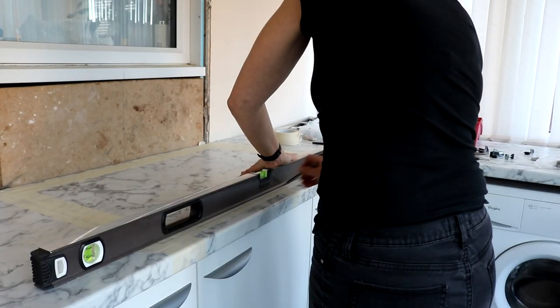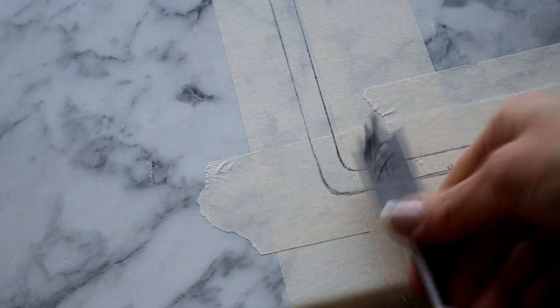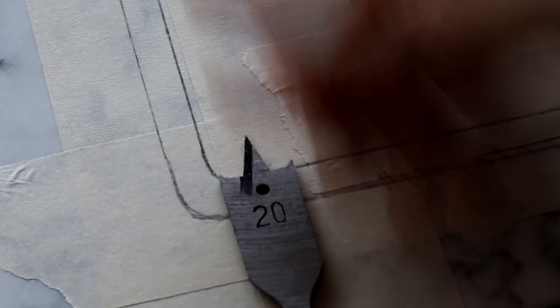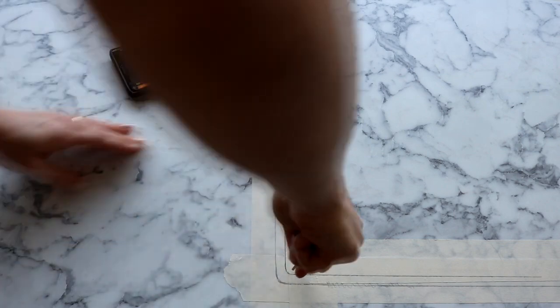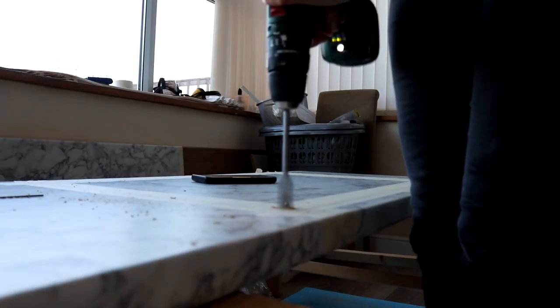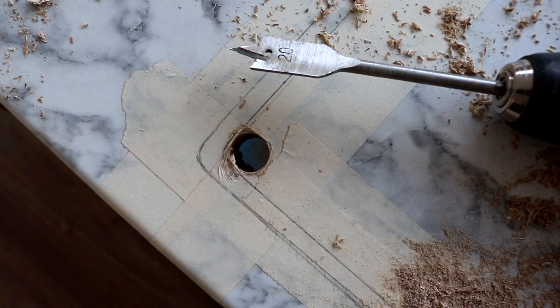For the corners I just artistically drew a curve. Then I moved the worktops to my sawhorses. I used a tip I'd seen in a couple of videos: line up a flat 20mm wood drill bit against the corner, lift it up and twist to make a little hole. I did the same in the opposite corner, then drilled a small hole between those marks to pierce an area for the flat wood drill bit to go through. I repeated that for each corner.